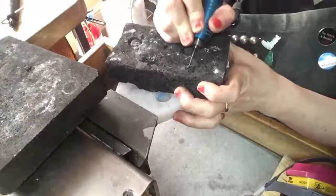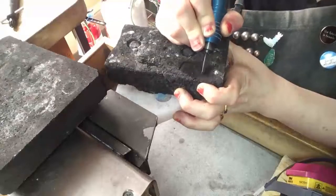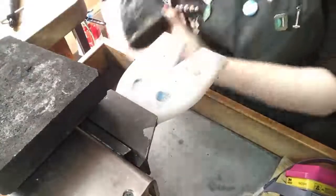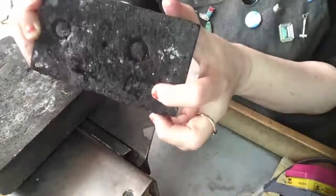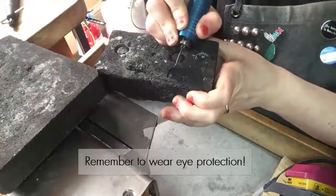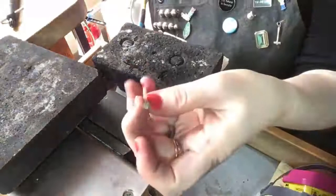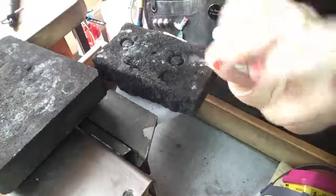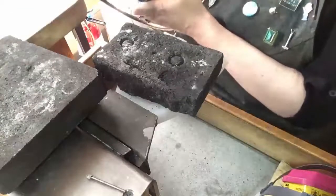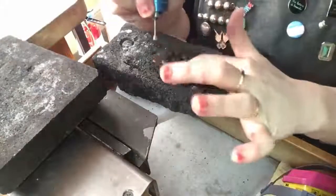If I wanted to make this into a little crucible, all I do is make a little rectangle to outline it, then continue to use the ball burr and carve it out. The other tool you can use is an inverted cone burr with a flat side — I'm going to use that to flatten and smooth out the base of this mini crucible. This is going to be good if you're ever making a small melt that you're going to roll down and turn into sheet, where you'll want the surface to be fairly smooth.